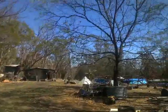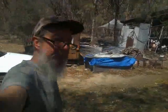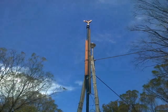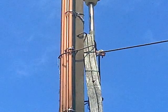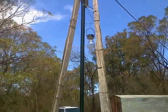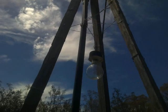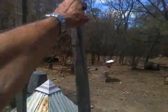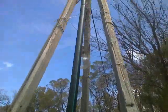So all I've got to do now is stiffen that thing and make it properly rotate. I tell you, a hillbilly's work is never done. It just goes on and on and on. Anyway, I'm going to try the quick fix now. Okay. Well, as I said, I think despite the fact that I've stiffened the pipe where it interfaces with the tower, it may be the fact that the tower has such a long unstayed terminal cellule. I think what I might have to do is come from here up to about here, perhaps here, put a triangle across there and diagonals in, because at the moment you can barely wriggle that. The whole tower wriggles.